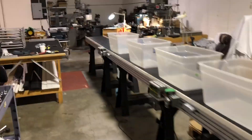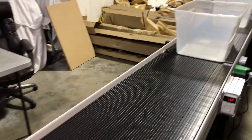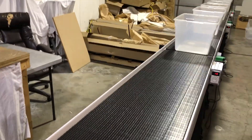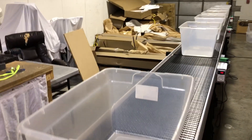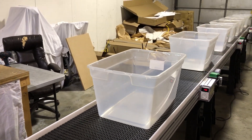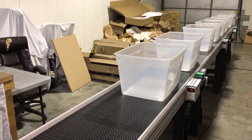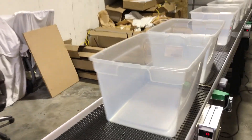Now I'm going to come down to the end and we'll see what happens when another box is put on the line. Here we have a running line. The operator comes up and puts a box on it — the whole line's not turned off, just this section is still on. Now it's going to go down to that zone... it's going to get to the other box. Nope. Shuts off. That's a zone.